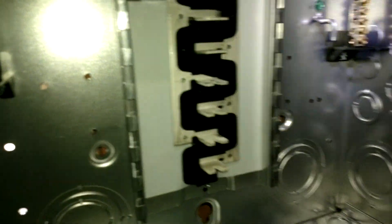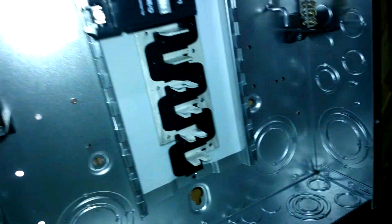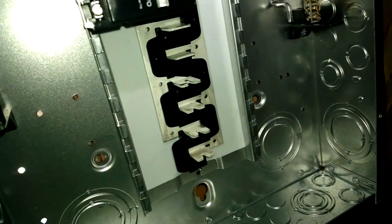This is probably the neutral side, and this is the grounding side. For a sub panel like this you don't bond the box to the neutral. I'll more than likely run a ground wire from this box down to the grounding stud. The back-fed breaker is already in up there.